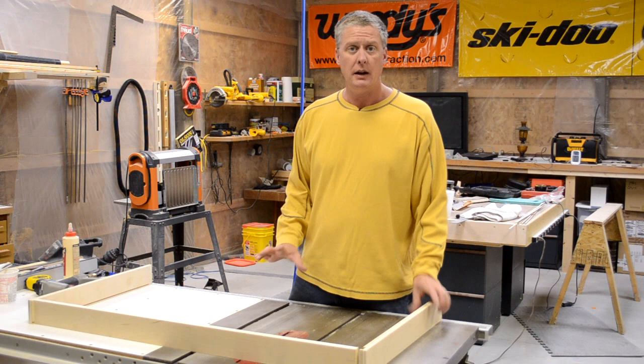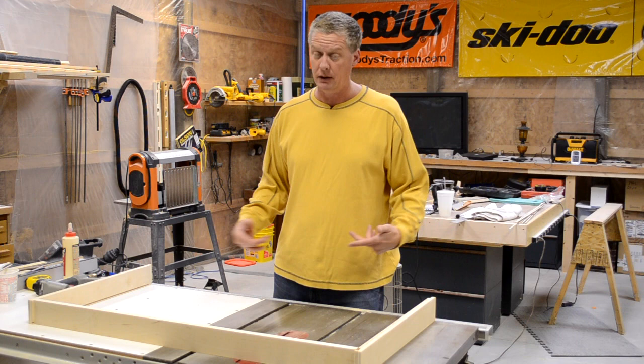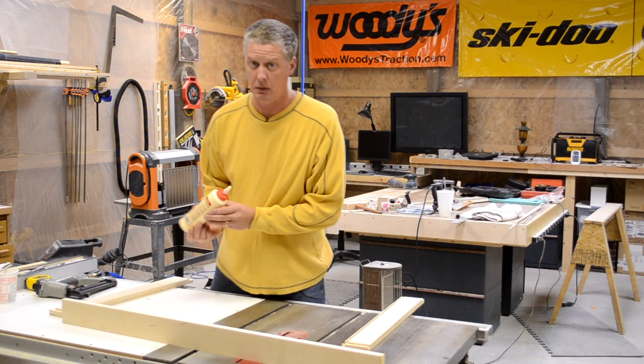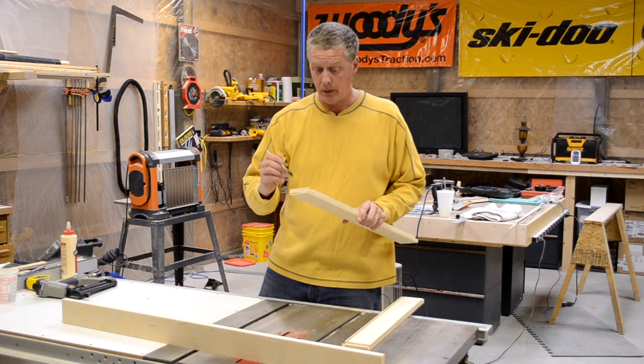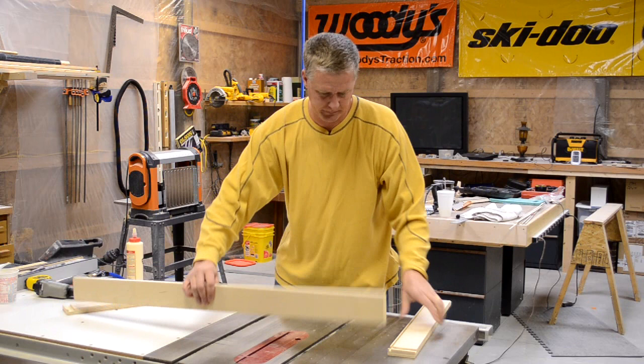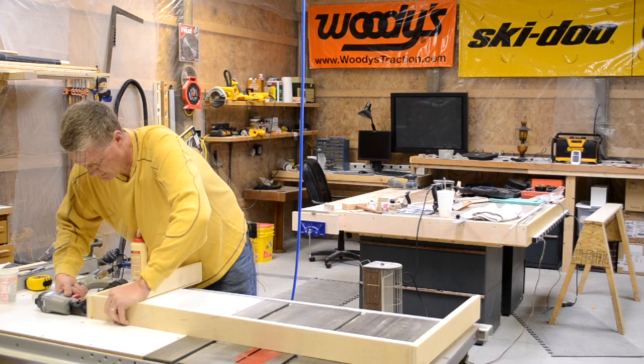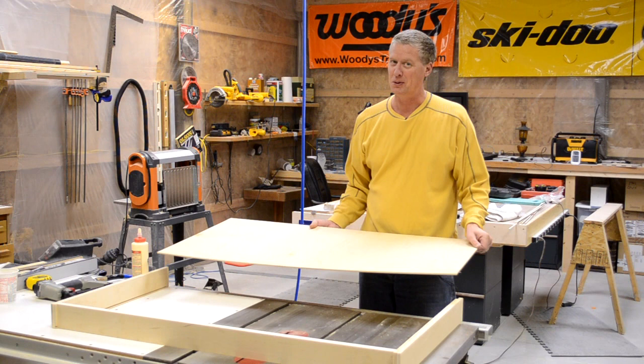All right, piece is cut, dado's done, time to assemble this bad boy. And just so you know, this is classic drawer construction. I learned this from Norm. Thanks, Norm. Without you, this wouldn't be possible. So, glue in the dados, and I'll attach everything with brads. Again, if it's good enough for Norm, it's good enough for me. Now the bottom. No glue, we'll just let it float.